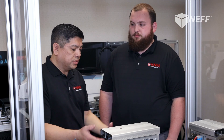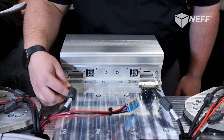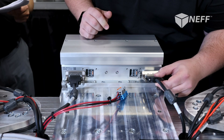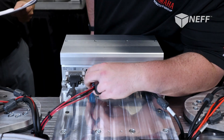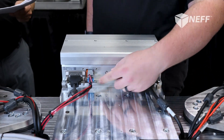For the electrical, we use what's called YC-Link, which runs on EtherCAT. The feedback communication comes in the left side of the module and exits the right side, daisy-chaining to the next cluster. We also have dual 48 volt power with separate control and motor power, which allows for semi-automatic loading stations for operator load and unload on a work cell.